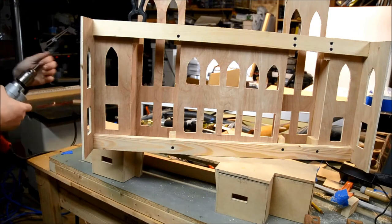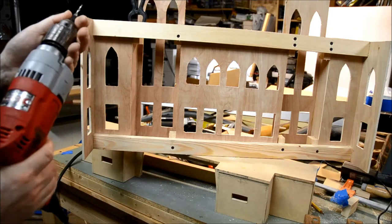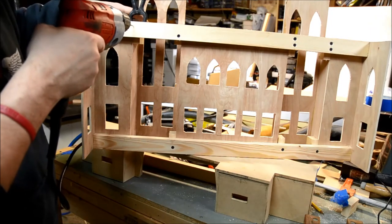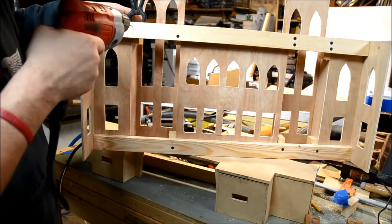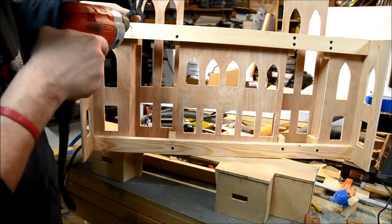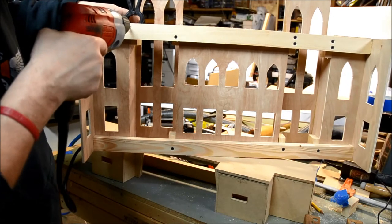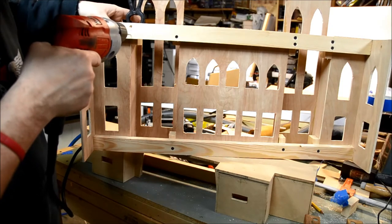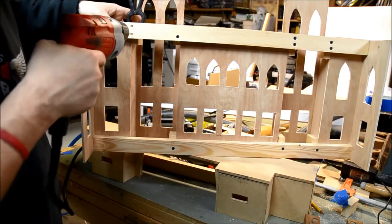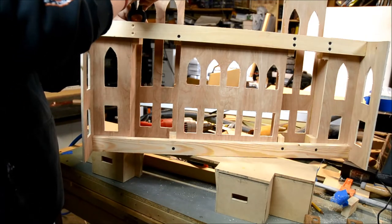I'm using one-and-a-quarter inch or one-and-a-half inch drywall screws, which are pretty good for this purpose. Just hand-tightening the drill, then putting two holes through the cross beam into the block. After this I'll be changing the bit and driving two screws with the drill into the hole.